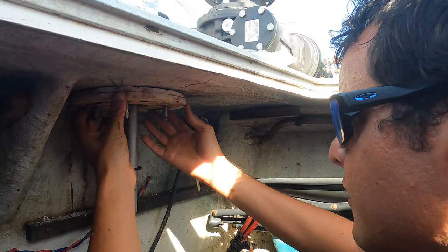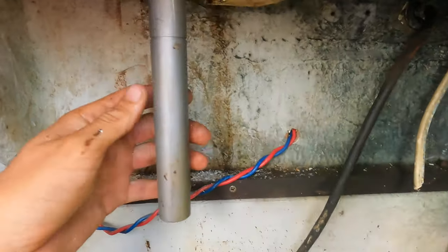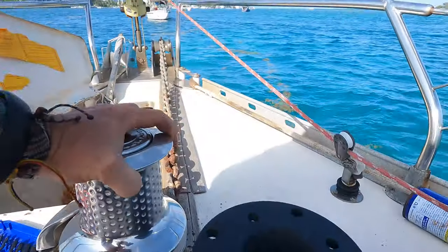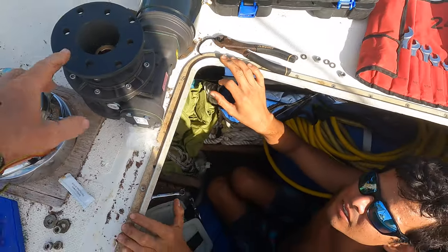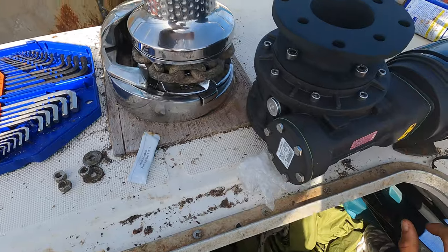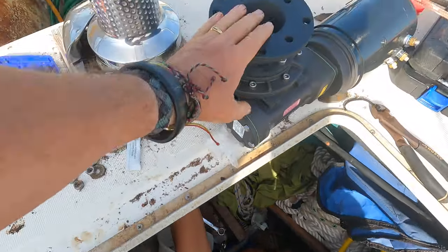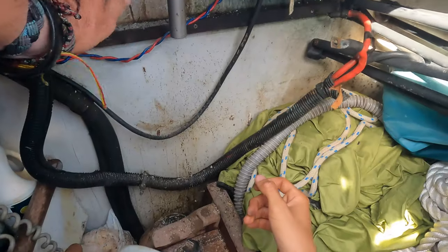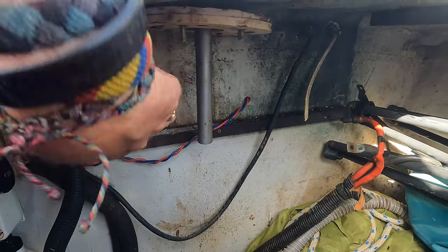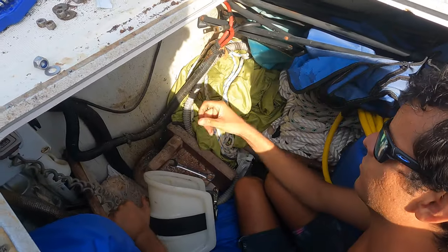This is important - you got to take these now. Don't let the key fall out - good, the key is in place. Now if you look at the motor here you notice that the key shaft is pointed forward, almost perfectly forward but not exactly. So we line this up - we've got it almost set now where it's almost perfectly forward. The first thing you're going to have to do when you lower this down is raise it up, line up the shaft, line up the key, and then as you push it up just turn it until you line up with these bolts. Then push it up again and as soon as you get it across these bolts, get one of these nuts and washers on there fast just to lock it in place. Once it's locked in place with one nut it can't fall off, and then the rest of the job's easy.